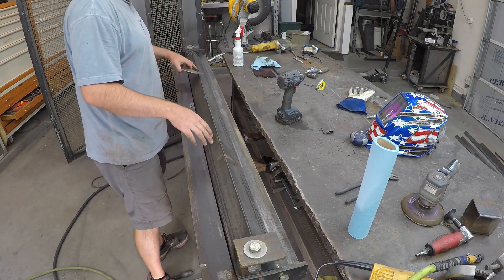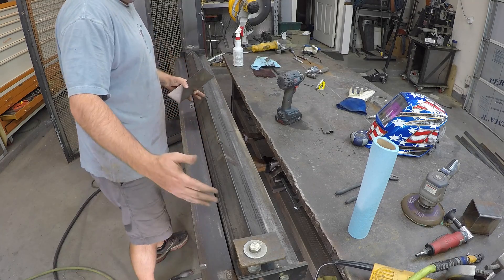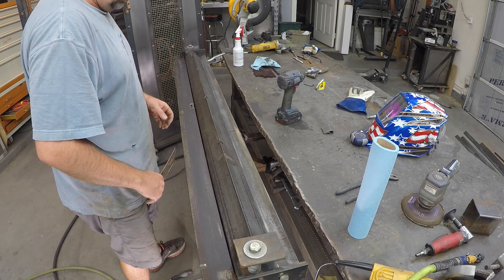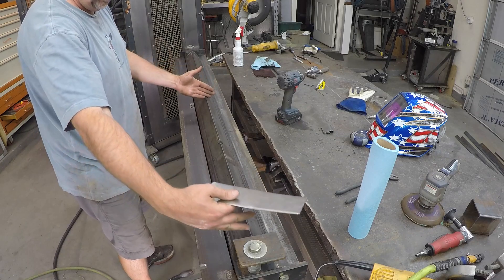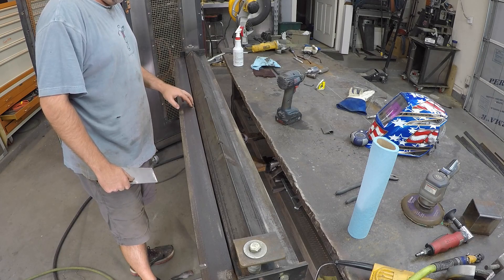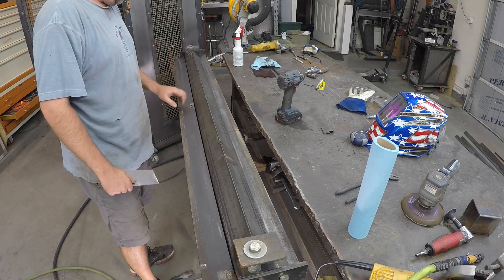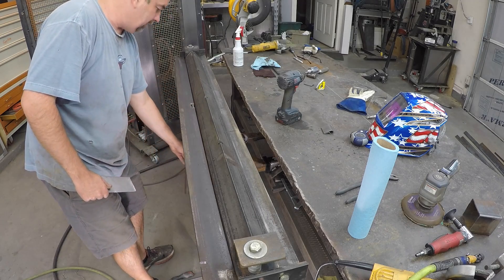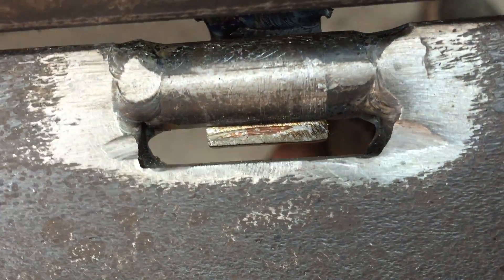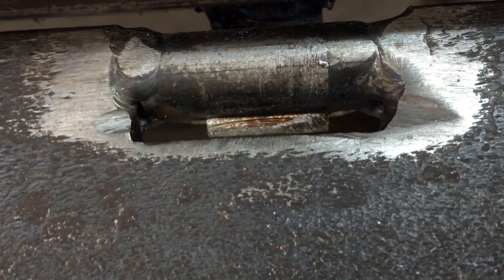We also finished drilling some holes that we started back then. These extra holes are so that if we're just using this section of the brake, we can put a bolt here and that way you've got a lot more rigid clamping than just from one point. We also worked on welding that strap in the center because with thicker material, when you pull up on it, this bar would want to separate from the torque. The round bar being in there is not really affecting anything — it's working and bending everything just fine.